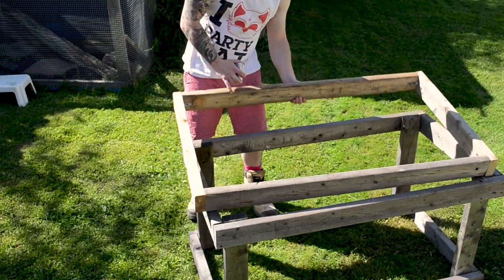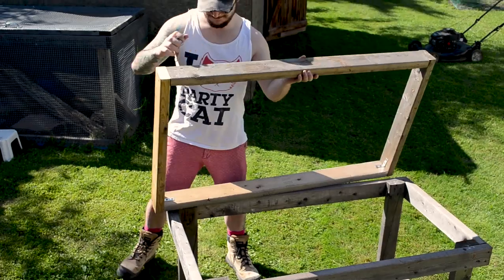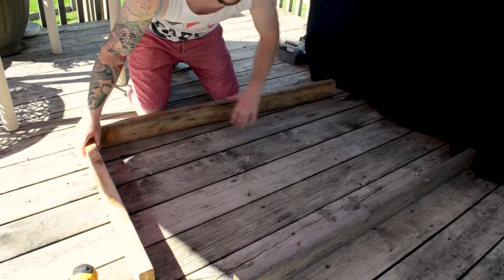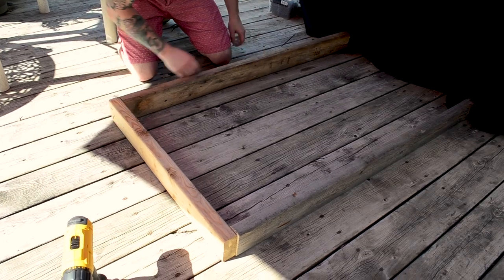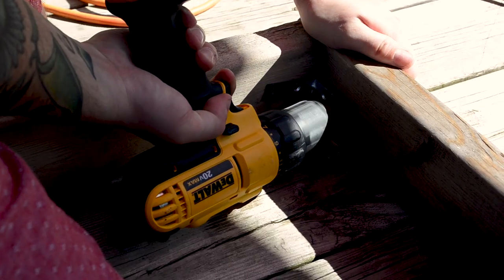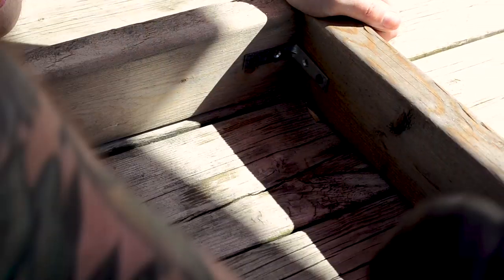For the next part, this is basically what you would do for the entire frame. We're going to make the lid or top of the enclosure. All you're doing is making a box out of the wood. I would suggest making the longest portion full length, because that's where your hinges are going to go. Drill it together and you'll have a lid — just follow the same instructions as for the body. I would also suggest bracing it with L brackets; I think these are 3-inch L brackets with two holes for screws. For a larger lid I'd suggest 5 or 6-inch brackets with three screw holes so it doesn't break.